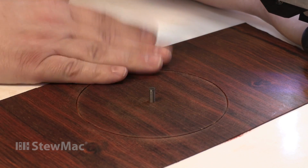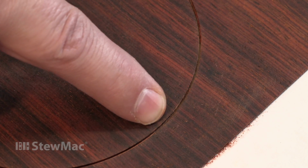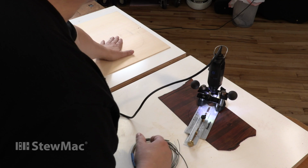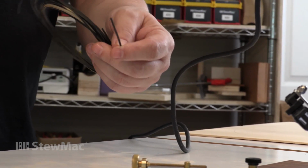If you look, I either see the white of the board below or I can see where I've actually cut into the laminate top a little bit, which is exactly what we want. Before we take the trimmer off and come over and cut our channel in the spruce, we need to set the depth for our purfling.